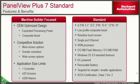The PanelView Plus 7 standard is a machine builder focused product for competitive machine builders facing pricing challenges. This terminal was designed for one controller, up to 25 screens, and 200 alarm applications. Terminal sizes range from 4 inch up to 15 inch, filling in the gaps beyond the older PanelView Plus 6 compact's 4, 6, and 10 inch models. These terminals have a single Ethernet port, a Windows CE 6.0 operating system supporting ActiveX controls, PDF viewer, and other features. They come as DC powered units with ATEX certifications.